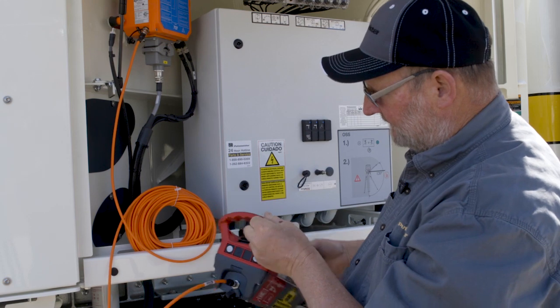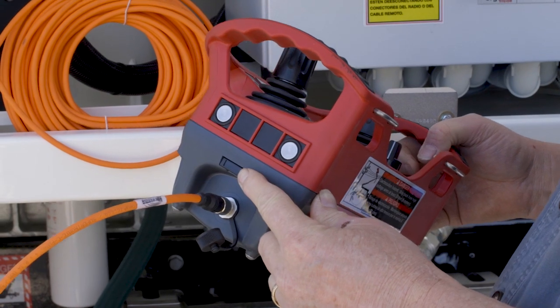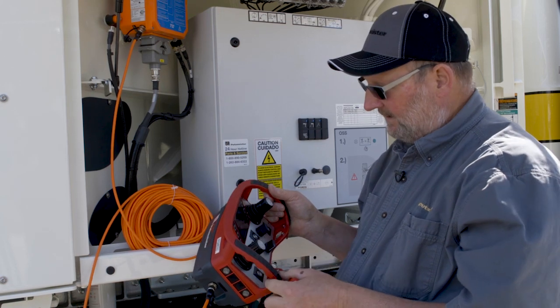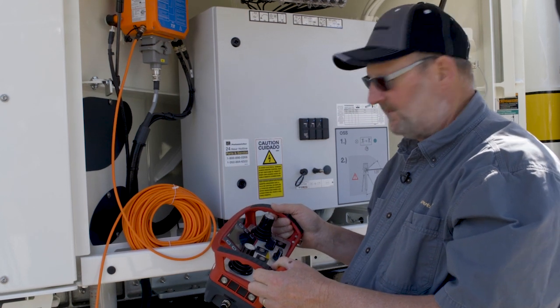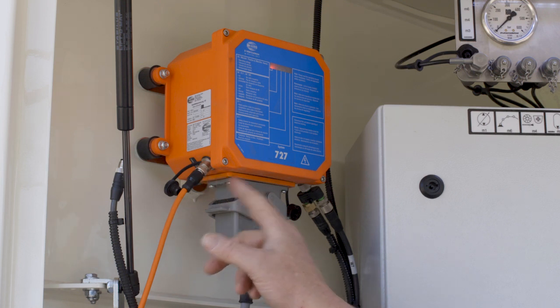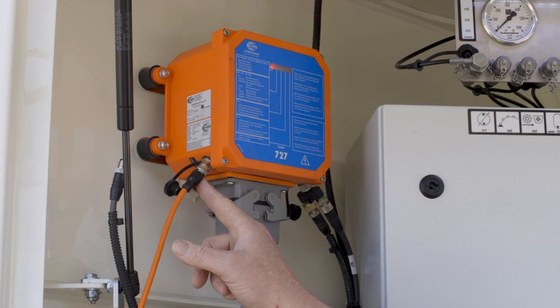Another important note: if the iLog chip on the transmitter is lost or broken, we will still communicate. Also, if the battery has failed, we will still function. So no matter what the problem is, we can continue to take care of the job with the hardwire cable. Note that the hardwire cable is plugged into the lower left corner of the radio receiver. Do not unplug the lower right corner — that is the CAN bus connection from the receiver to the computer system, and it needs to stay intact. Hardwire is only connected to the radio antenna out port.